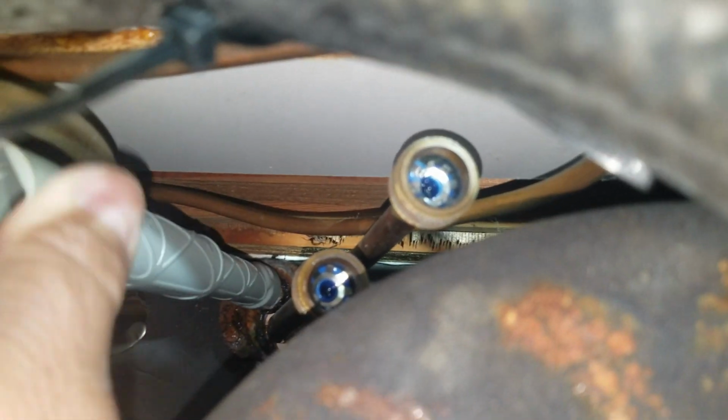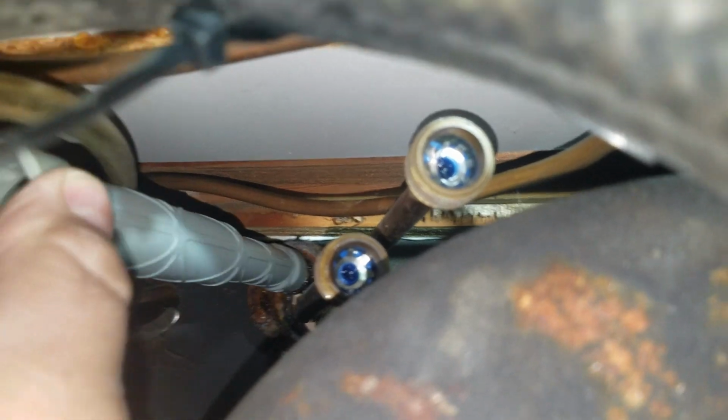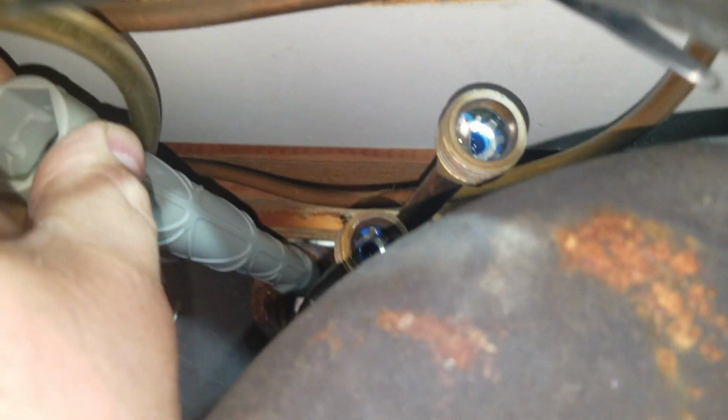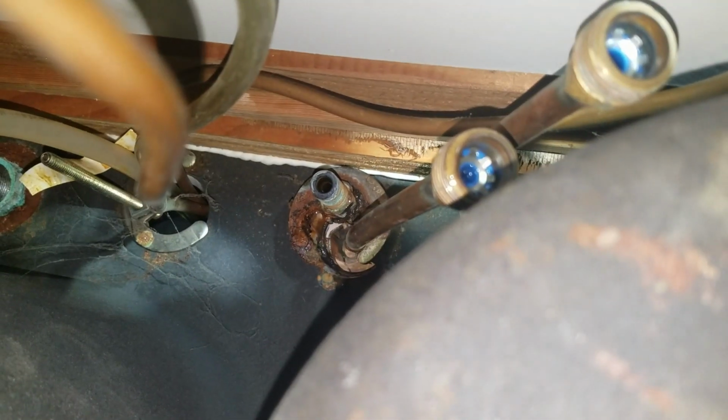And then I'm using the tool that comes with the new faucet. Kind of a cheapy plastic wrench, trying to undo that bolt. However, as usual, I can't do it one-handed. So anyway, that's the general idea. You have to pull the hose off, and then there's a second nut that holds that retainer under the sink to clamp the faucet down onto the sink. So that's what we are going to unscrew now, and then the faucet head will just pull up.